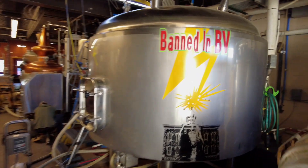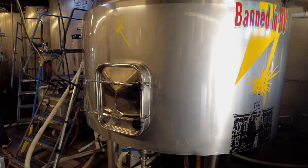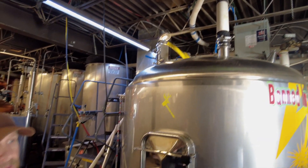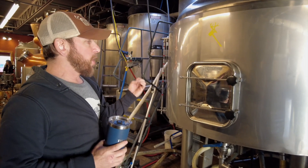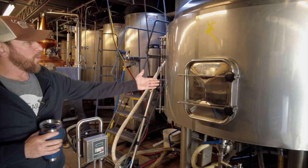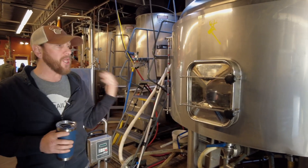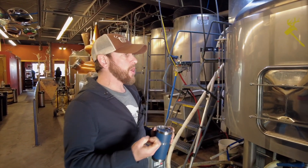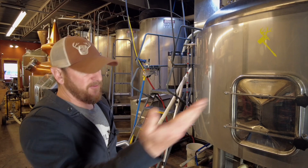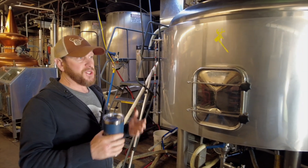What you'll see right here is a 20-barrel mash tun slash cereal cooker. We primarily make American single malt, and this is designated as a mash tun for that — it has a false bottom that allows us to separate the milled malted barley from the liquid for our wash. But today we're making bourbon, so the false bottom is out. We're about to grain in, stir it all up, cook that corn, break down the starch, get the enzymatic activity happening, and convert our four-grain bourbon grain bill — corn, wheat, oats, and roasted barley — from starch to a fermentable sugar.